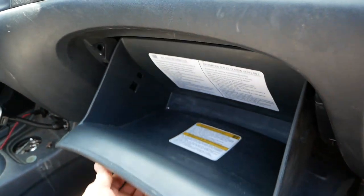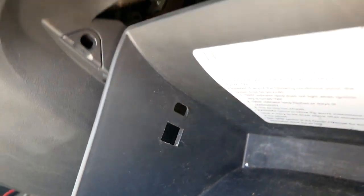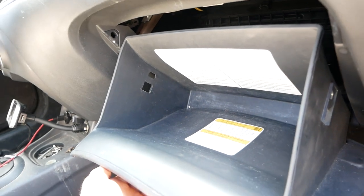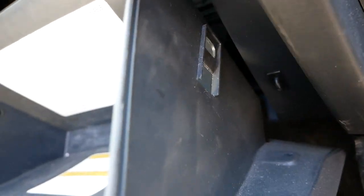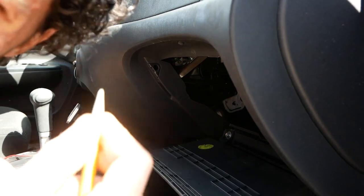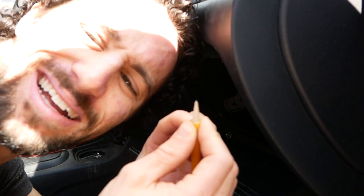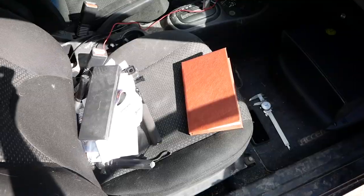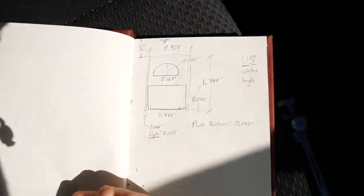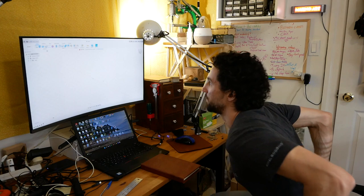So I think ideally this stops right here — like all the way open, maximum access. And what I need to figure out is where is the stopper point on the clip? It looks like it's going to be past the back, so I need to try to measure that somehow. Maybe it'll be easier on this side. I'll just poke my pencil in — I'll pencil it off that. So it's about the length of the conical part of the pencil. I think that's what I'm going to base it on. Is it half an inch? No, it's three quarters of an inch. Alright, so I got all my measurements done. Alright, Fusion 360.